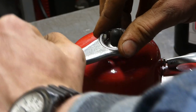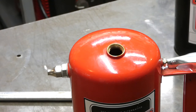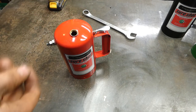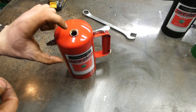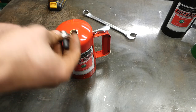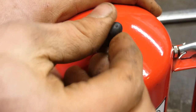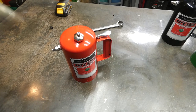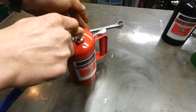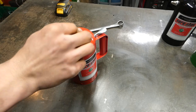They arrive in a plain box with a simple set of instructions. I'm going to take a 15/16 wrench and pop our fill nut off the top just like that. Now the catch with these is you fill them about two thirds of the way, so there's enough volume inside for that pressurized air to shoot out the whole contents of the canister before running out. Thread this back on and underneath this rubber boot we've got an air fitting. You fill them with a minimum of 80 pounds of pressure — basically just go until you hear the air stop. And now you're all set up to spray.